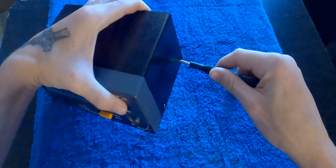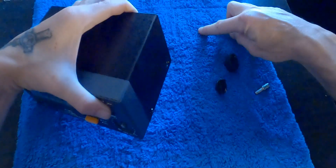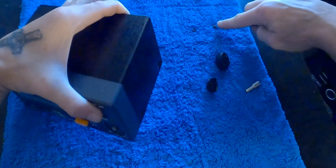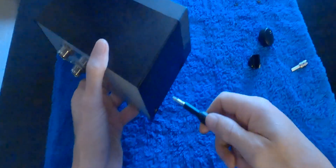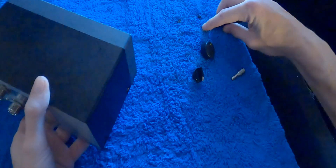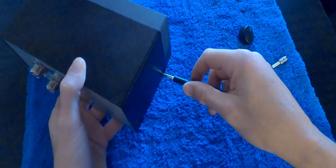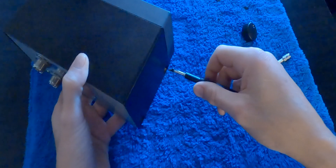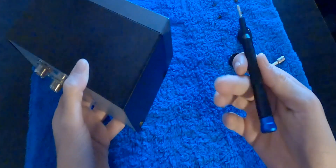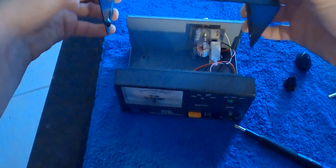When you first get it — I've already taken it off because when I first got it, it wasn't working because the ground connections were undone, so I had to solder those together. When you first get it out of the box, these screws on the outside cover are Loctite — I almost rounded them just taking it off. Since the piece that's loose on the inside of the meter is small, if it wiggles its way out I'll pull it all the way out to show you what actually broke. The iFixit screwdriver I'm using has removable magnetic tips. To get the cover off, you're going to take the bottoms and pull them out to the sides and lift up.